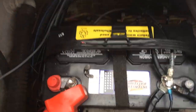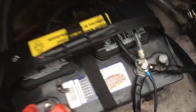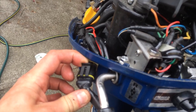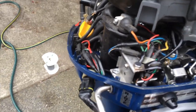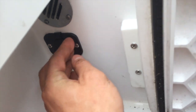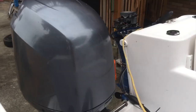There's a breaker for the main boat back there. Right now I'm also installing a power supply from the Kicker. I have this old Honda motor, which is awesome — still starts on the first pull — and I connected the power output from the Kicker so I can charge my boat batteries. I kind of needed that because I got these electric downriggers and I'm trolling a lot more, using a lot more power when the main motor is off.